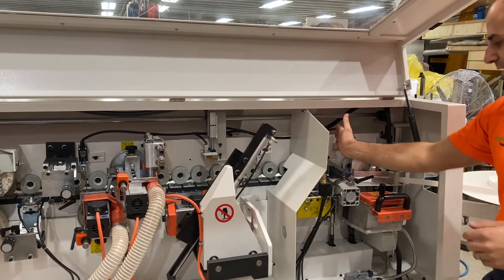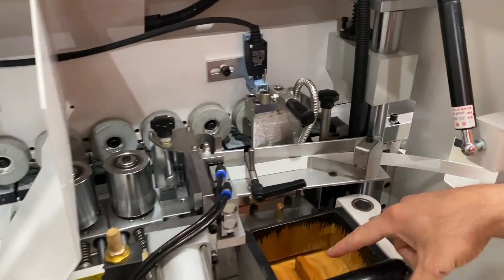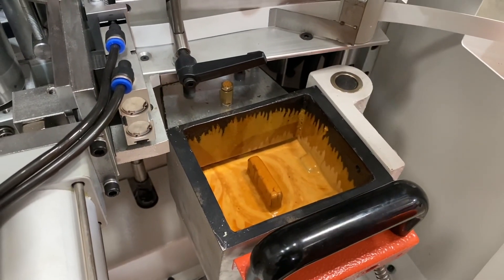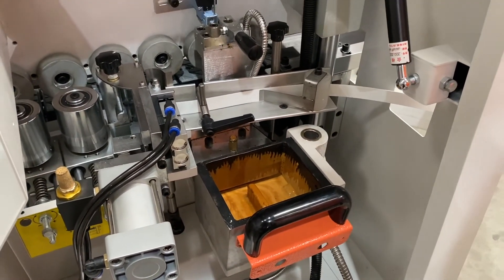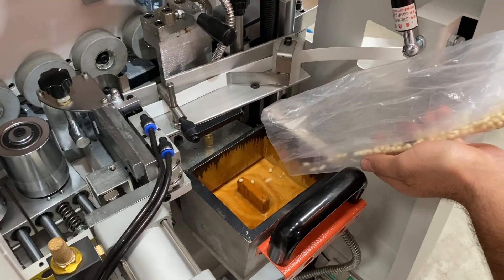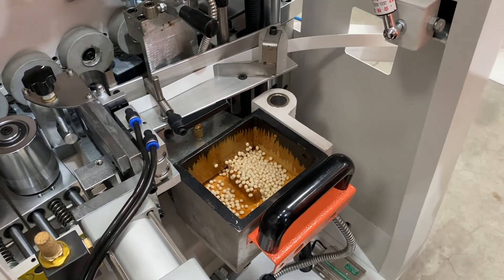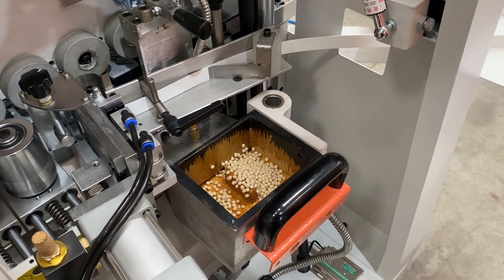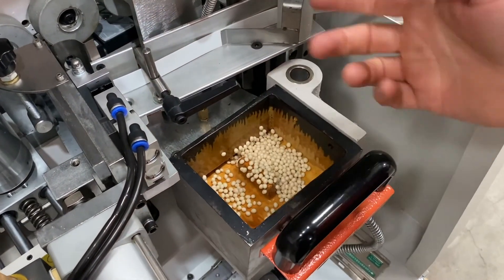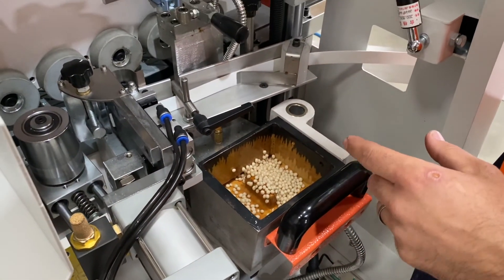This is our glue pot here. To put in glue, we just pour it straight into the pot. The pot is Teflon coated, so don't use anything sharp in there, otherwise you'll scratch the coating — that coating helps prevent the glue from sticking. When you want to put a bit more glue in, basically just pour your glue in as pellets and then let that melt. Once the glue's melted you can keep running and it'll mix with the old glue that's in the machine, keeping it a nice consistency and stopping it from burning.